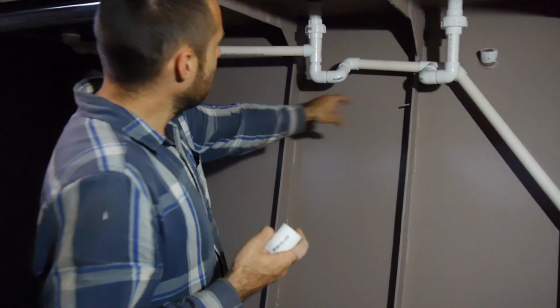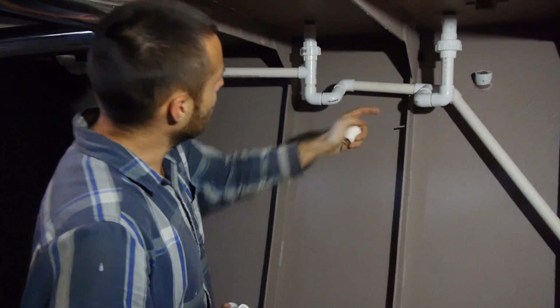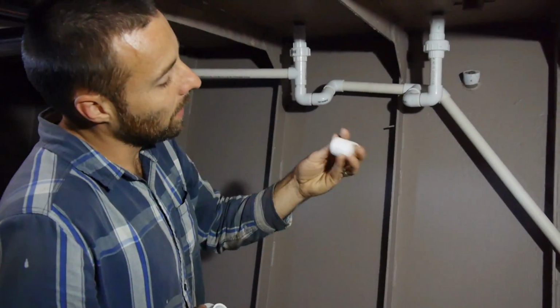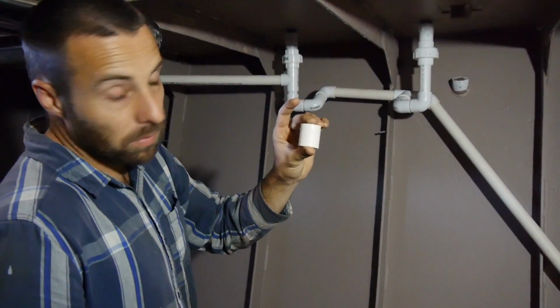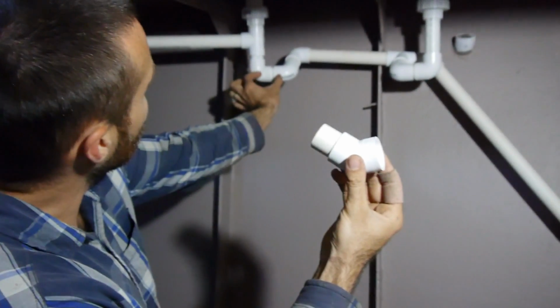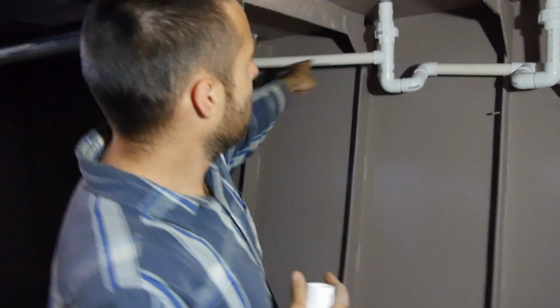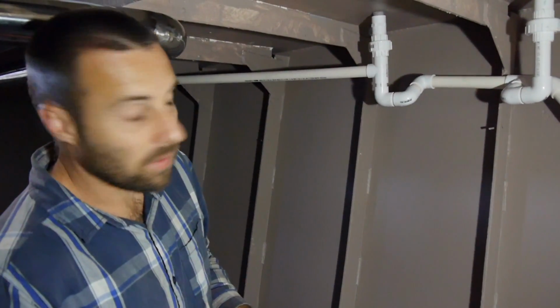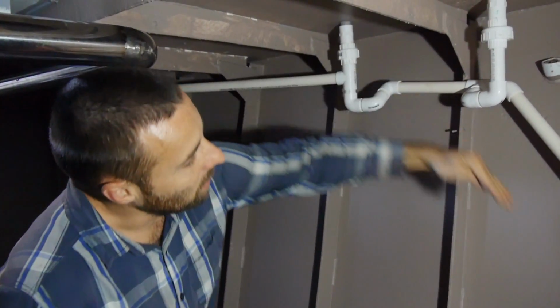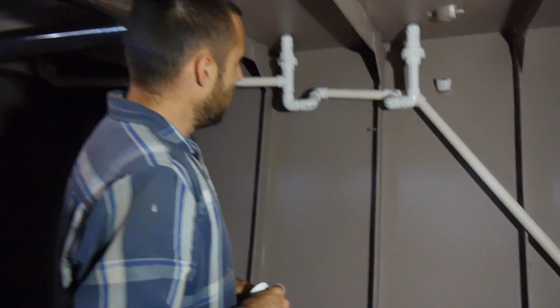So in the soft fit up stage, you've got a lot of joiners connecting corners and things like that, and you use these little connector pieces. So it's just a piece of this 25mm pipe, and we just cut it to be a bit over an inch, so 4 centimetres long. So what's that, like an inch and a half, something like that. We slide it halfway into a piece like that, and then that piece there connects. So within these two, that joiner is about that long, if that makes sense. So in the soft fit up stage, you can see we basically assemble it all. It'll be sitting as it's going to be sitting when we're finished, and we always try and get a downward flow happening. So gravity is always going to try and take the water and so on away.